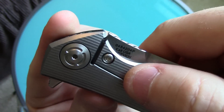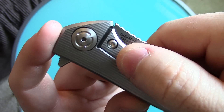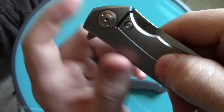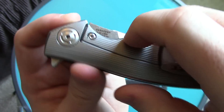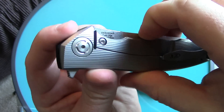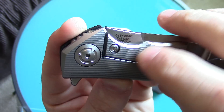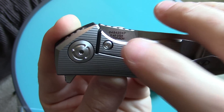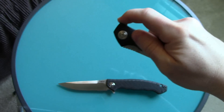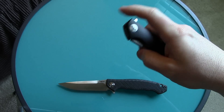You can hear it — it's a lot more audible. When the lock bar goes further down, just a little bit of pressure and the detent ball falls in too deep — cannot deploy it, no matter how hard I push, it's impossible. Then I pull it back out. You can see the lock bar move and hear that click. So now — no problem again. I can't freaking believe it, I've never seen anything like it.